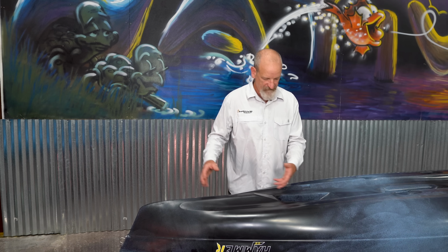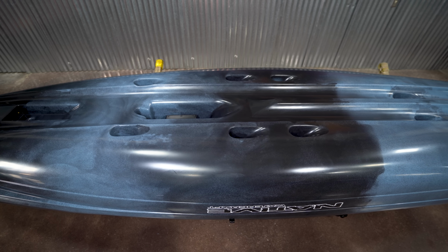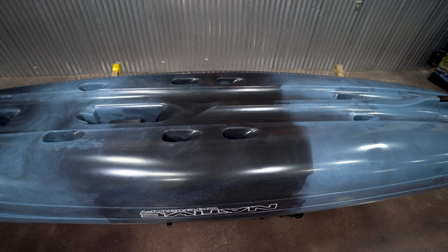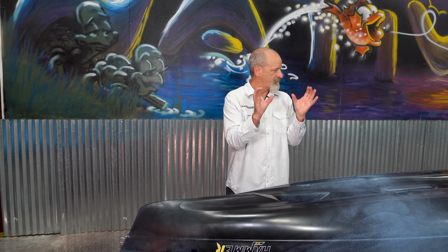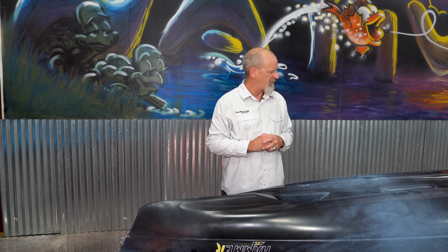Moving back, we've got our classic transducer pocket, and you can see the long channels going down the center of the boat. I've widened those channels out slightly and made them round and consistent so that you can use bunks on trailers very easily. This will slide directly onto a set of 5-inch bunks.